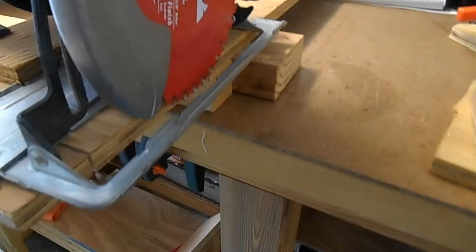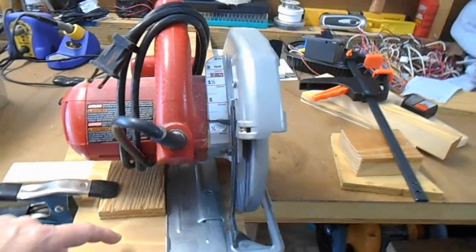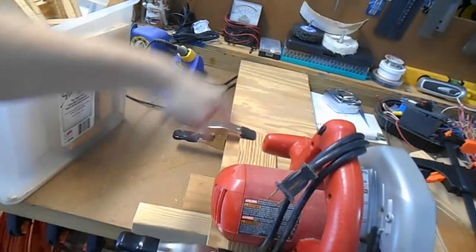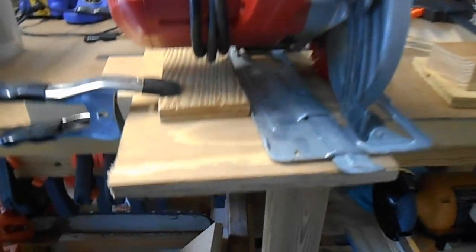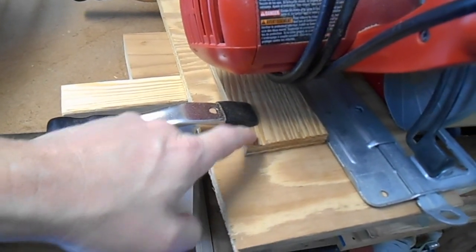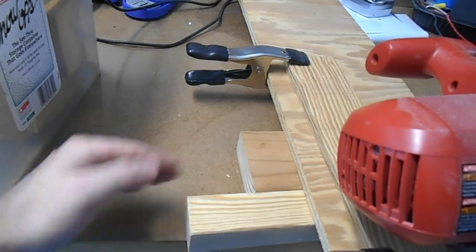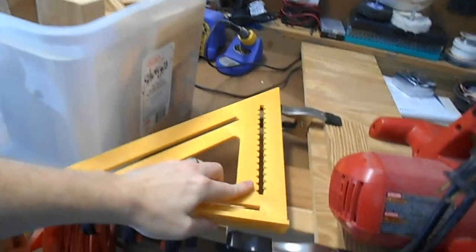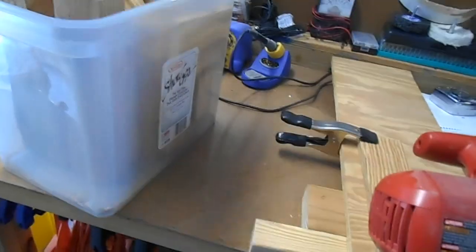I've got the circular saw, and this is the example piece I'm using. I've got a piece of plywood that I will end up ripping slightly smaller in width and cutting to a shorter length, because I don't need it to extend all the way down this far. These two clamps are holding on what will serve as a guide fence for the edge of the shoe. This piece is going to be cut square and will be the T section of what would ordinarily be part of the speed square — the piece that hooks on the board to be cut.